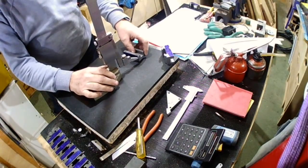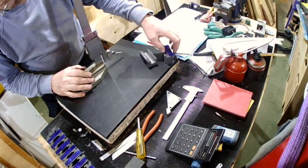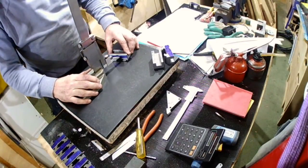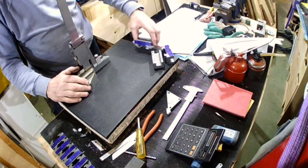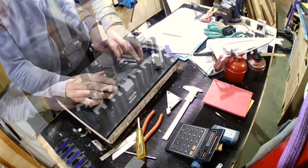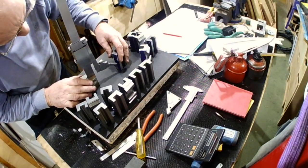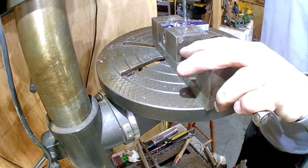I'm using a vernier scribing block against each tool holder to mark the height of each screw line. I also use the scribing block to set the spacing between each tapped hole. I'm using my granite block — it's a homemade one using 15mm thick granite tile bonded on top of a 2-inch concrete slab cut to the same size. It's still very heavy, mounted on 3 small feet, and it's as flat as I can get it using diamond paste and two pieces of granite worked one against the other.